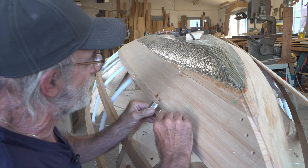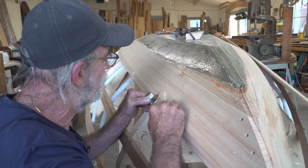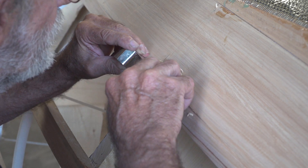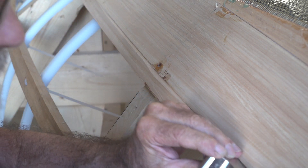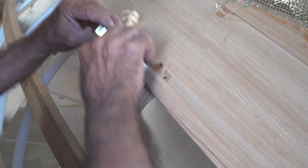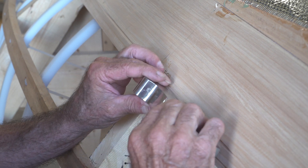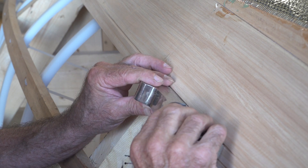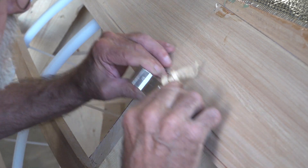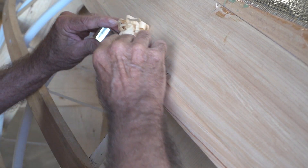Now I can follow the trench without even looking at it. I've got the very corner of my rabbet plane on the line and I've already made a few passes so I've got some depth. Once I have a little depth I can go a little bit faster. There's a little hill or corner right in here — if I try to tilt the plane down and knock it off, I'd ride up on the edge, so I want to leave that. As I make a few extra strokes I'm going to start to tilt the plane over gradually, not all at once, because I would just mess up my work.